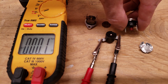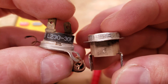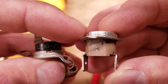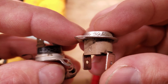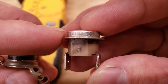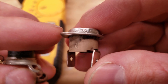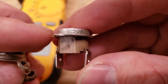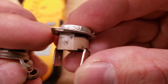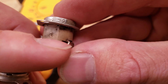You can see the button on that one. Here you have two thermal safety limits: this one is 230 minus 30 and this one says 165 minus 65. This one is normally closed until it reaches above 165 degrees, then it's going to open up, and it's not going to close these connections again until after a cool-down period when it gets down below 100 degrees — 165 minus 65.